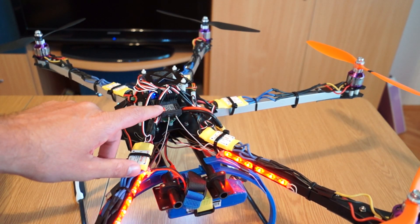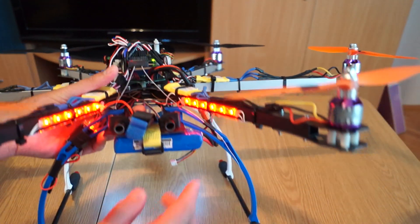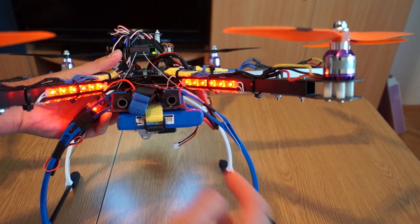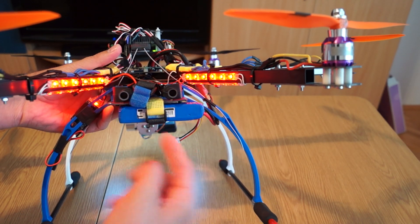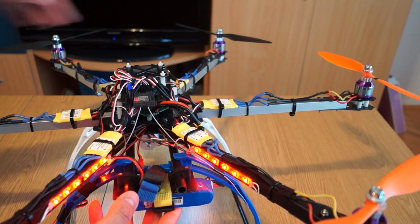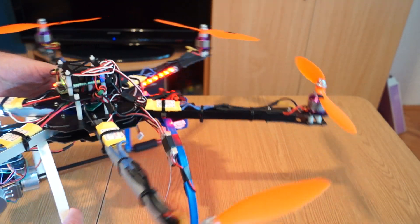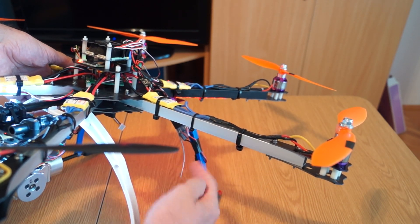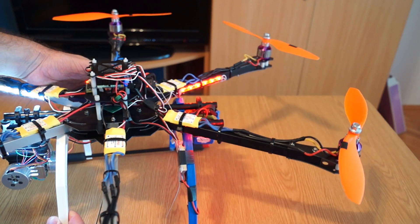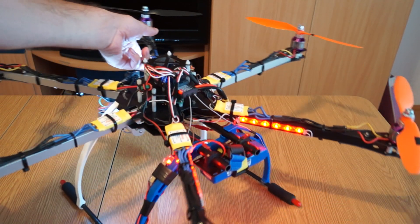In the back you can see the Valkyra RX 1002 — that's the receiver I chose for this build. The two long antenna leads: one I put in the back so when flying in that direction I get more signal on that antenna, and when it's facing me I put the other lead forward to catch the signal better from that side.